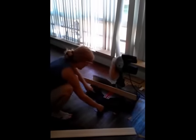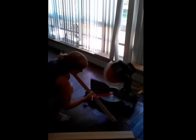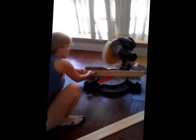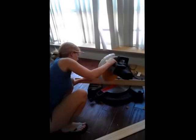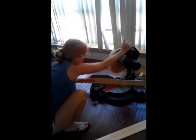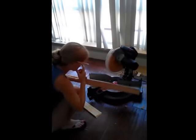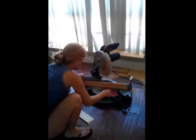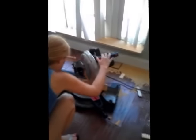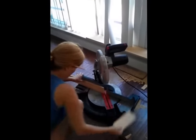You basically have to turn the chop saw to a 45-degree angle either one way or the other depending on which direction you need to make your cuts. To do the miter cut, we want it going this direction — you have to measure exactly where you want the inside of the miter cut to be and cut starting there. The baseboard has to sit flat against the back and you have to hold it upright to get that outside miter cut. Now we have our miter cut ready for the other side, so we turn the saw to a 45-degree angle the other direction and cut to size.